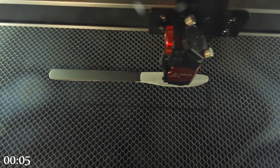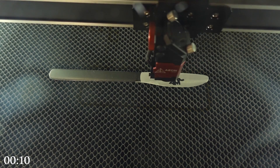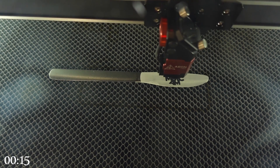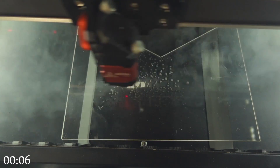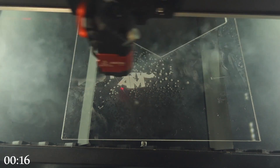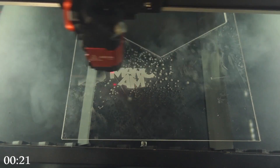We'll have a look at this stainless steel knife now. With the marking liquid I put on there — again this is in real time — this literally took seconds. See how nice and black that engraving is. Now we're running a quick engraving on acrylic. I probably went too high power on this — I believe it was about 15% power and around 300 to 500 millimeters a second — and you can see it absolutely bullets through that in less than half a minute.